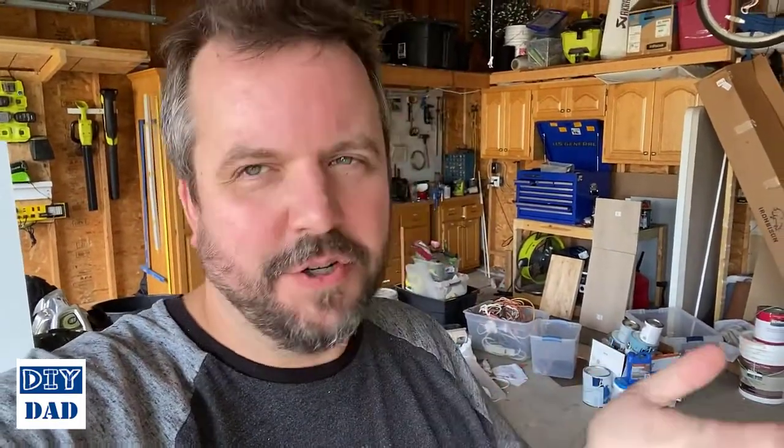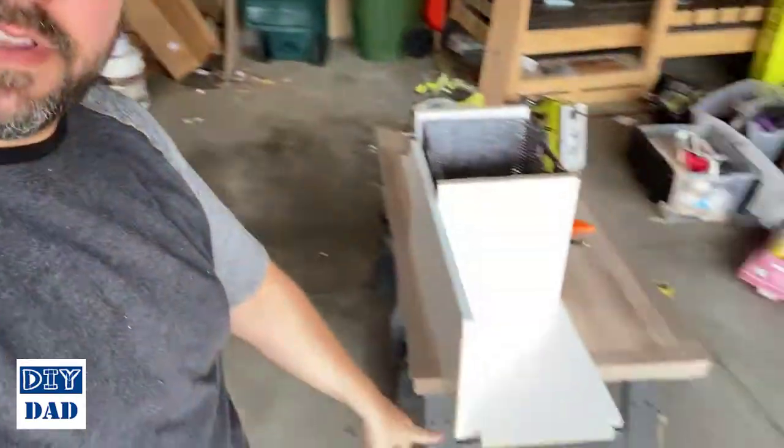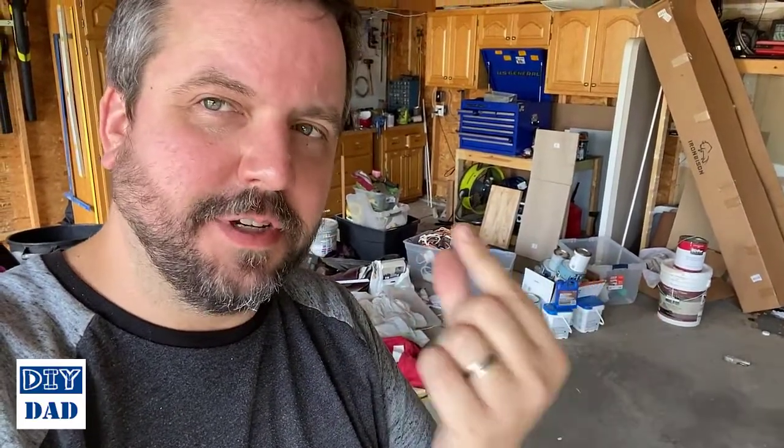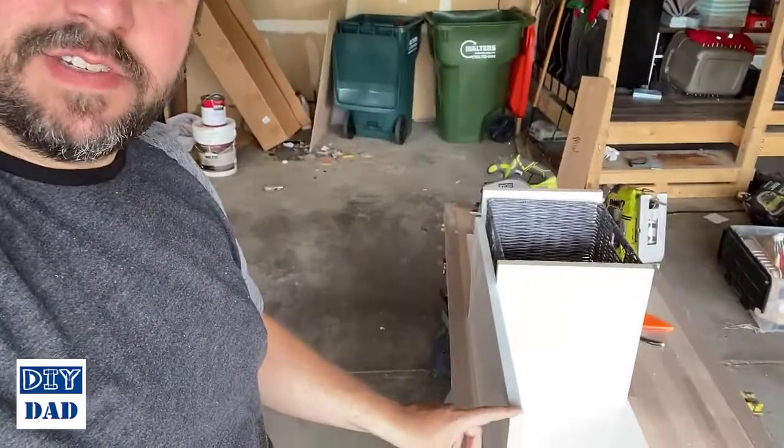I'm a big believer in these videos of showing you my actual process, and anytime you do a design build, you're subject to learning as you go. So I made a mistake. I'm going to be able to cover it and you won't be able to tell when I'm done, but if you're following along and trying to build this bench and you're trying to be artistic with this little offset, don't do what I did. When you're cutting the back hole, instead of running it at 1 inch by 1 inch, you need to actually leave enough room to accommodate for the back of this so that this board doesn't stick out too far, and I'll show you what I mean.